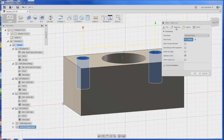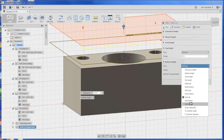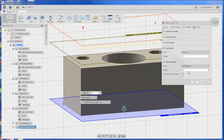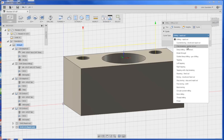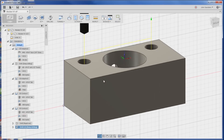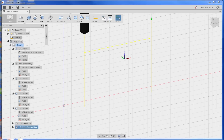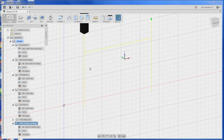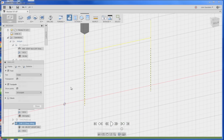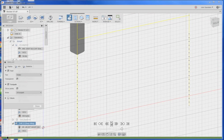We'll change the heights — hole top all the way through the model bottom, zero. Deep drilling, full retract, looks good to me. This is kind of cool — if we turn off the model and simulate it and turn off the stock, you can see the little black divots. Those represent the peck points, which I think is kind of cool.